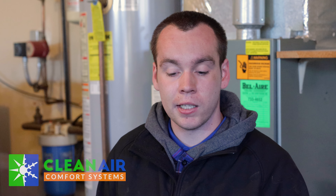The process for taking a tank water heater out could take about an hour, maybe a little bit longer depending on how much sediment is in the bottom of the tank blocking your valve where the water comes out. Most of the waiting is just draining your tank. Then installing the new one involves mounting it, hooking up new exhaust, replacing the gas line — because a tankless takes a three-quarter inch line instead of a half inch — and running new exhaust for the tankless as well.